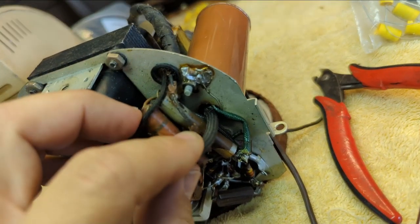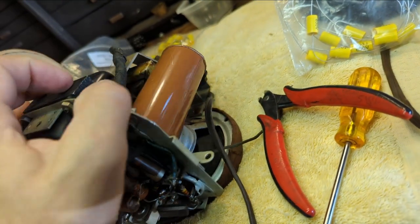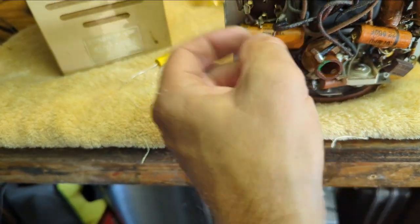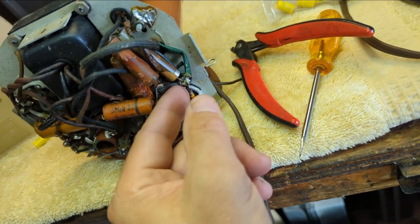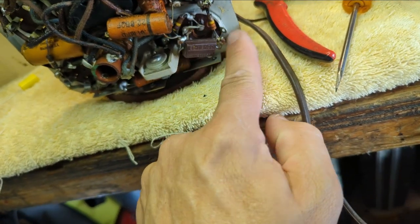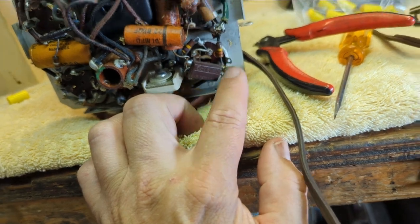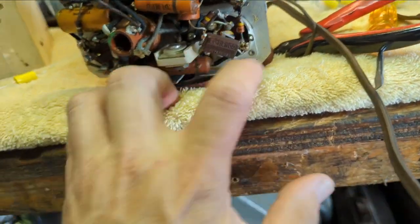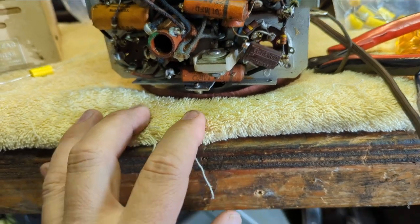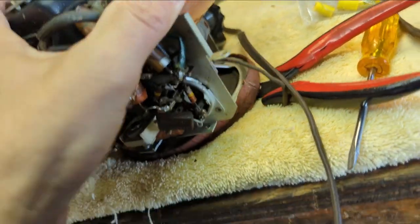And it looks like the capacitor, I'm going to check the schematic just to make sure, but I'm pretty sure that must be chassis ground. And then we have these two leads. One's going to the rectifier tube. That would make sense. And then the other lead goes, where does that go? That goes to this pin number. What is that? 1, 2, 3, pin number 4 of the 6F5. And through this capacitor, probably should go to one side of the field coil. Where's the field coil? It's on the speaker coming down through these holes.